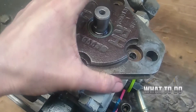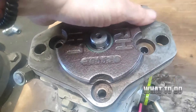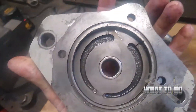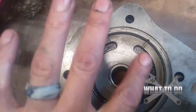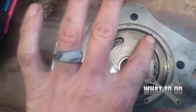With any pump you're unsure of, be careful — some of these have little balls and springs that will pop out, so pull this up extremely slowly. Always take pictures or video as you're going. There's also going to be a gasket under here. What you want to look for on the charge pump is any big digs or scoring. This one has some normal wear and tear but nothing to be alarmed about.